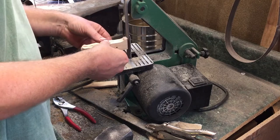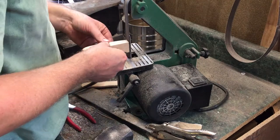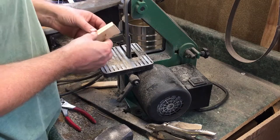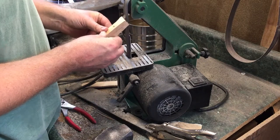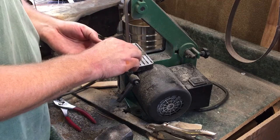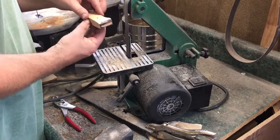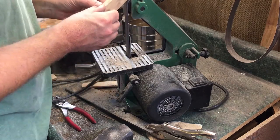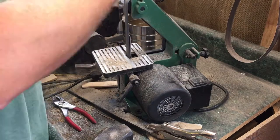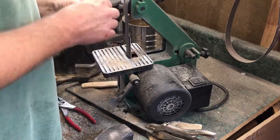In particular, that cleanup is going to be in that ricasso area where the grips will meet the blade of the knife. I want to be sure to get that cleaned up without scuffing the knife, because I've already done a little bit of work on that blade and I want to make sure I don't mess that up. That's really just a rough cut to get most of that material off so that I can really begin sculpting down a more ergonomic grip.